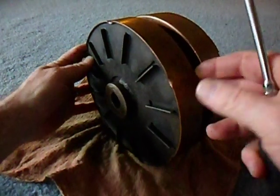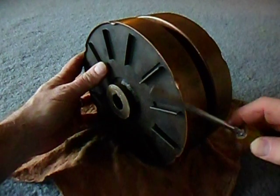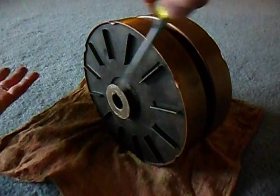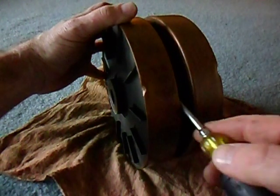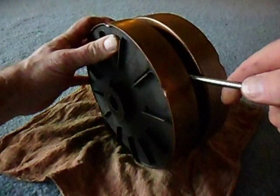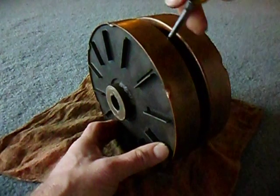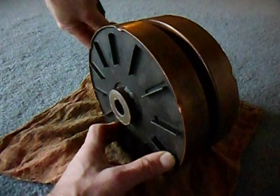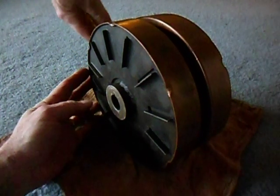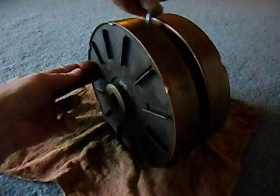Well, how the field is actually set up — if you feel around it with a screwdriver, you can tap on it — there's no magnetic field on the edges. But you get in the middle here, very strong magnetic field on both sides. And then if you take and rotate your screwdriver or whatever around, you can find the point that it kind of cogs at.